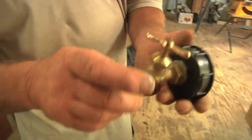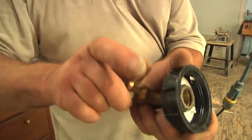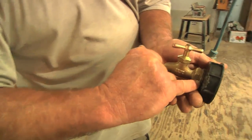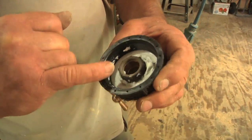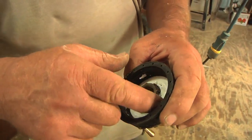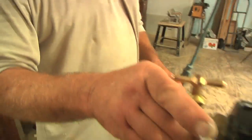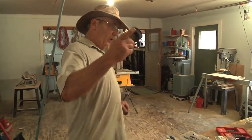So what we did is we took a three-quarter inch brass faucet, drilled a hole in it, got a stop nut on this side that we threaded on, and then we've got a nut on the other side. This just happened to be some hardware we had laying around, so we're making do with what we've got. We put some sealant on the thread first, and this goes on the water barrel and we're in business.